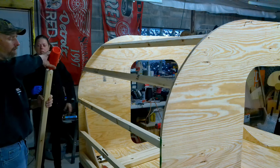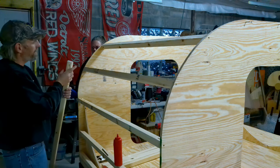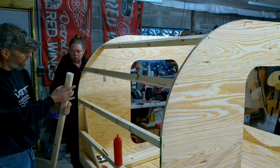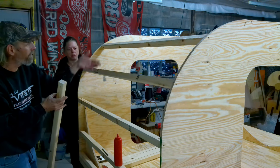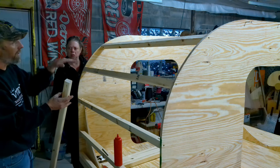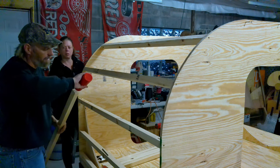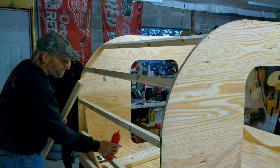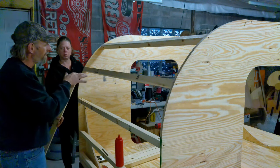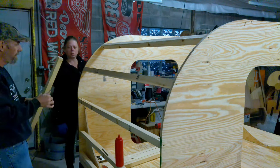Cut side toward the back, or you can do it toward the front. When you're using a 2x4, when it comes from the factory, it's a true inch and a half, so you know it's going to be consistent all the way through. If you're inconsistent when you rip them down and it's a little more, then you get waves when you put your skin on, and that's what you don't want. You just got to stay consistent. And the 2x4s are pretty regular at an inch and a half.